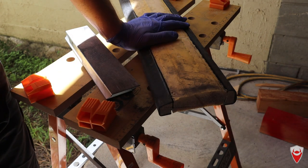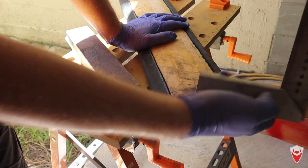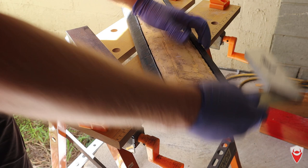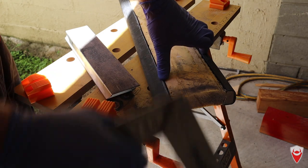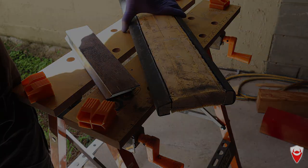One thing I've had to do that wasn't really expected was actually just square up the ends. So all I've done to do that is just use a square, run it along there, because it's not a perfectly smooth surface here, in that direction, also in that direction there, and look, they're close enough for what we're doing, because they'll then be adjusted with the next segment that goes on, and also with the front. So those ends are done.